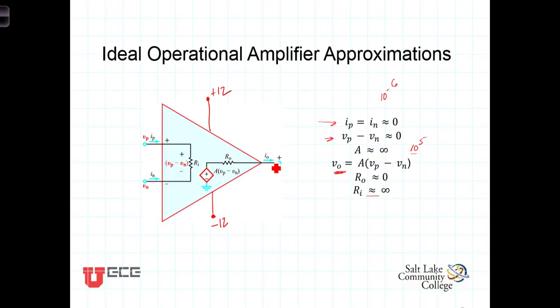And it's that feedback resistor. Whoops, I'm taking it the wrong direction. This is upside down from the ones we've been looking at. There needs to be a feedback resistor going from the output to the inverting terminal to constrain the output between those two voltages. Because those become the limits, those are sometimes referred to as the rail voltages. They are the voltages beyond which the output will not go.